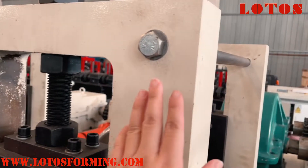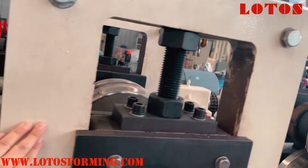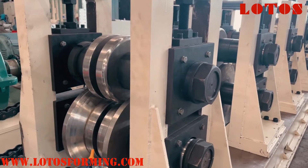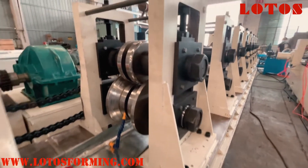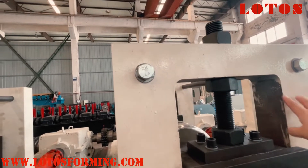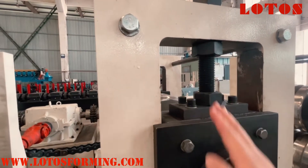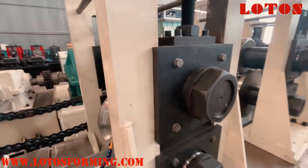This is the casting pillar stand. This kind of pillar is made from casting — specifically the T-block unit. This T-block unit is made from casting; it is an integrated structure, not assembled by welding. The inside is well machined and the surface will be mounted with heavy-duty roller bearings.